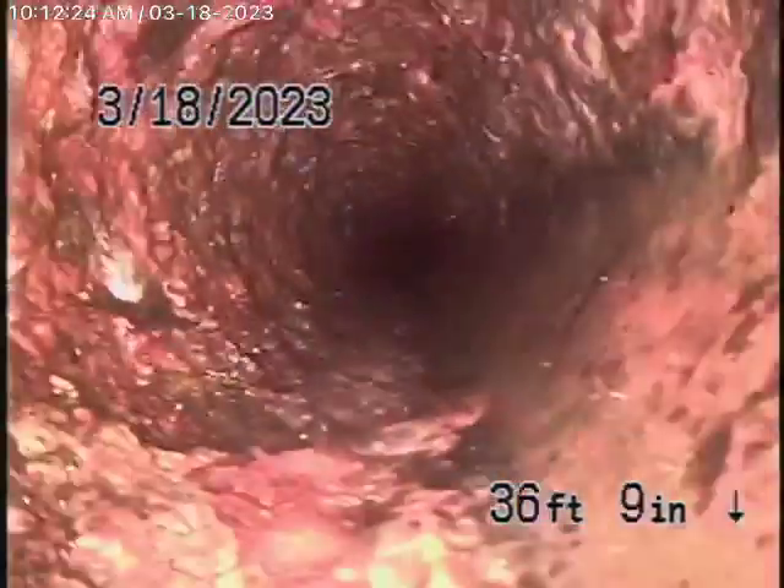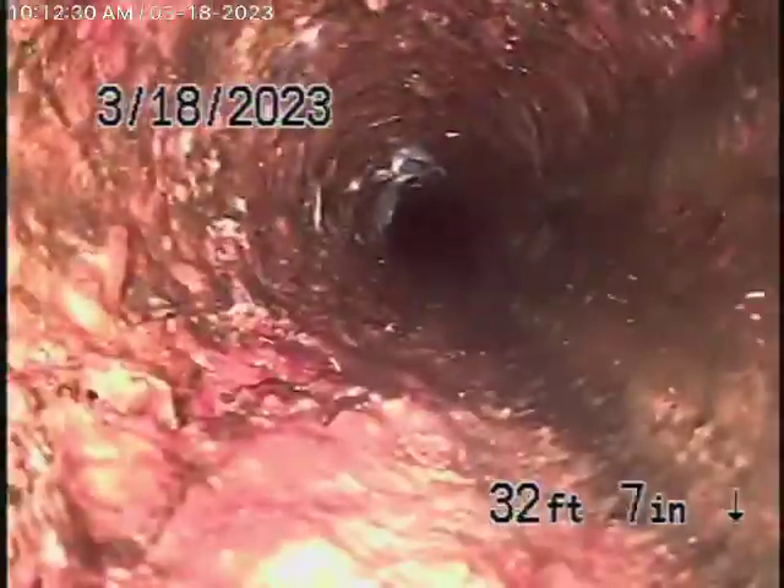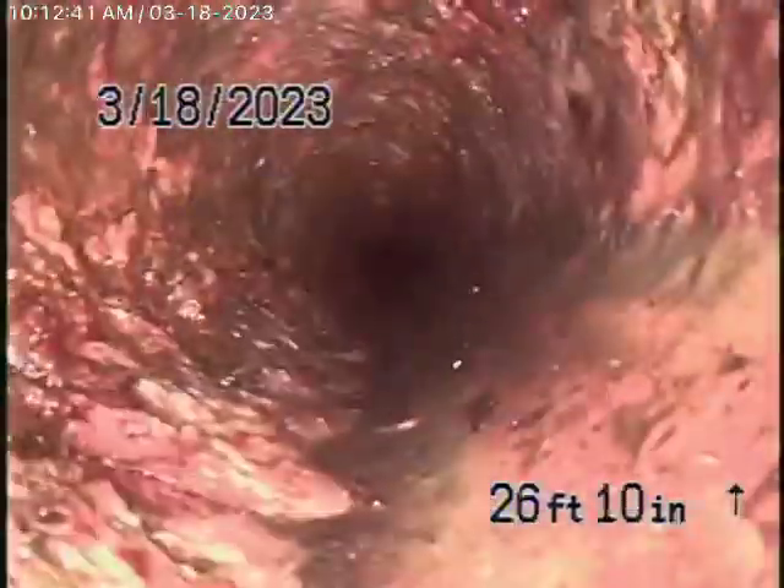As we look at the pipe coming back, it looks like a three-inch cast iron pipe. It's obviously getting a little old but still appears to be in pretty fair condition — it does have some minor rust buildup. If you put a two-way cleanout outside, a three-inch two-way cleanout since this is a three-inch pipe, you'll be able to clean the line coming upstream in the event it ever blocks up.